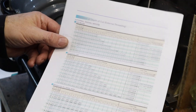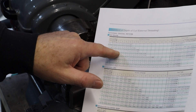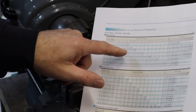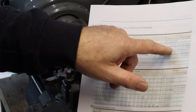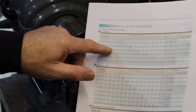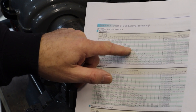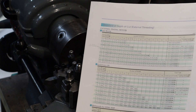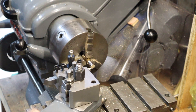According to this chart — I don't know if I'll be in focus there — this is, I think, for CNC with a ground insert. The first pass is .22, .21, .17, .14, .12, and then the last pass is .06. But I'm just going to do 5 thou passes and then a clean-up pass.